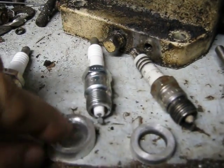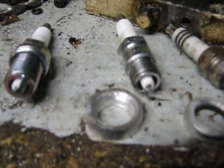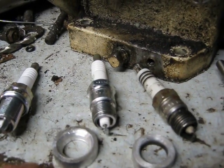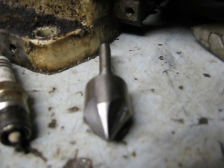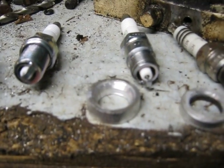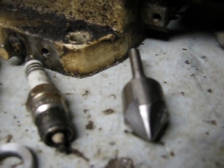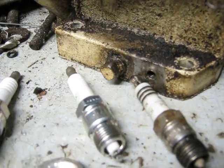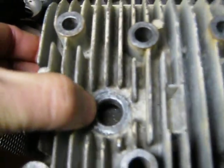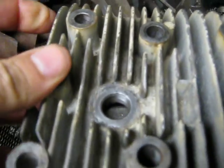I've tried to duplicate it here. I just had some quarter inch aluminum plate, so I drilled holes in it, then drilled the 9/16ths and countersank it. I actually used a 3/4 inch bit to go in a little bit to get the proper depth that I needed — countersinking the seat so that it meets up to the seat on the spark plug and gives you a good seal. And of course it has to be flat on the bottom side since that's where it sits on the spark plug mounting surface on the cylinder head.